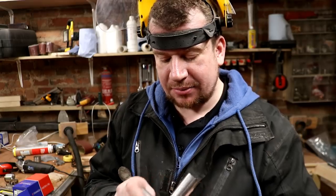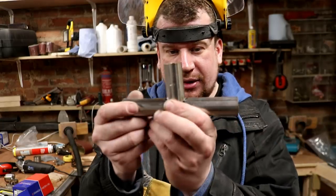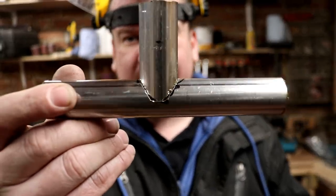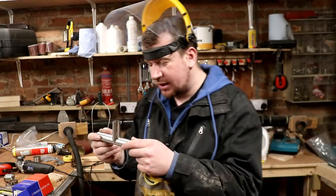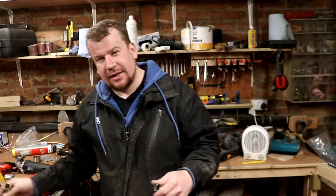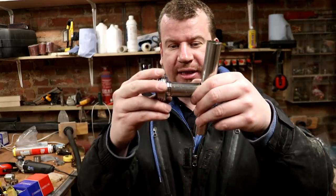I think that, apart from it being a little off-square, it will make quite a nice welded joint when it's finished. That's not bad at all. Get it purged on the inside with some argon and let's see how she comes out. I've spent all day welding today - wow, it's already gone five, it's ten past five. So I'll probably just finish this piece, weld these RJT fittings to them, and then I guess we'll call it a day.